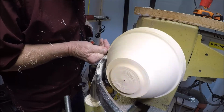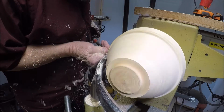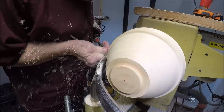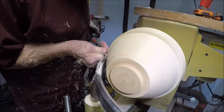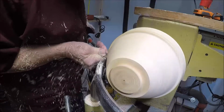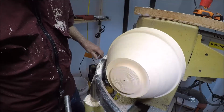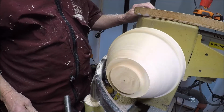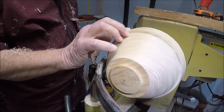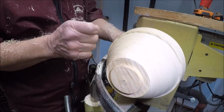Let's go in here. I've got sighting down the bevel, picking up the little shoulder, opening up the bevel a little bit, opening up the gouge so I can go in there. Lost it, picking it up again, right up to the end, and there we go. Hot chips on my thumb. I don't have a right-handed glove handy. I'm getting a little bit of a chip out inside the groove there by the bevel.